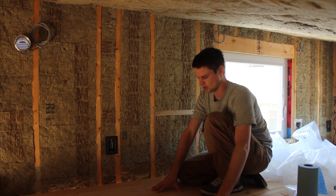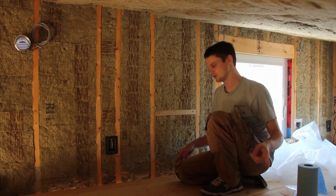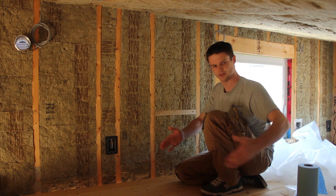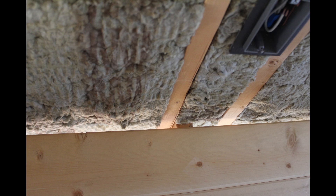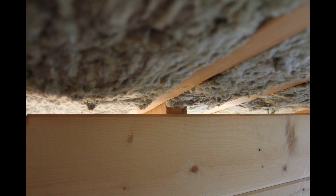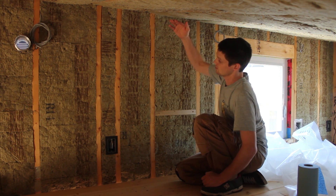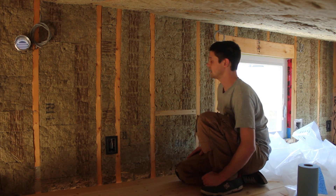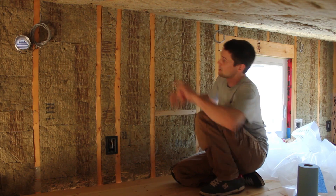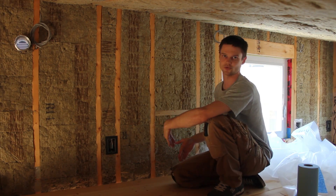At the time of filming this, we've installed the loft boards but haven't put out a video on it yet. Because of the way the spacing worked out, there's a slight gap between the long walls and the edges of the loft plane. We'll deal with that in the end by putting some trim over it. But it actually simplifies getting an unbroken vapor barrier on this wall straight down past the loft level. I'll get the pre-cut sheet up and show how I'm going to slit it to make some flaps to pass through the gap.